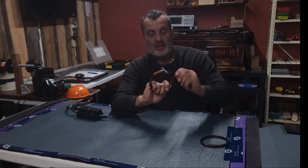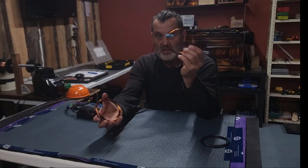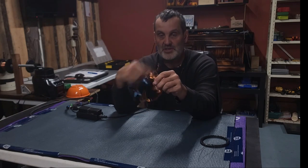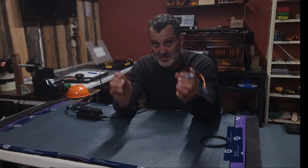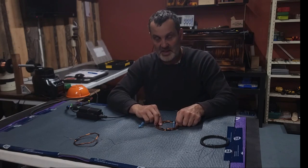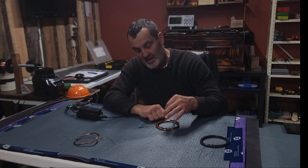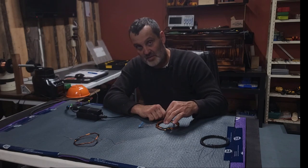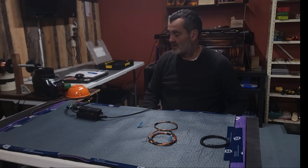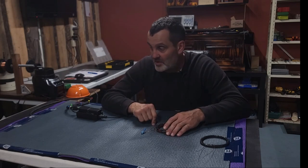Wire them together so they become one coil. If each coil makes 10 gauss and you have three, you'll be making 30 gauss — they do add up together. The caveat is polarity: if this coil has north up and south down, and the next one is the opposite, when you put them together they cancel each other out. To test it, grab a small magnet — if it vibrates when you place it there, you're doing good. If it doesn't vibrate, flip that coil. Do the same test for each one and you've got it.